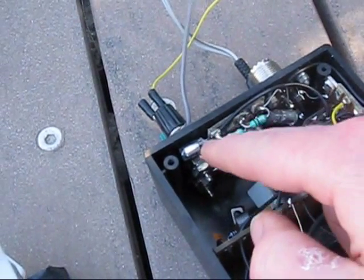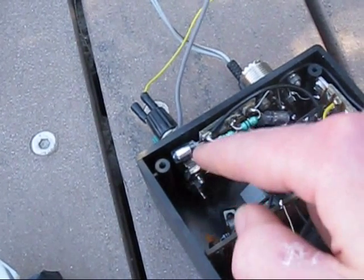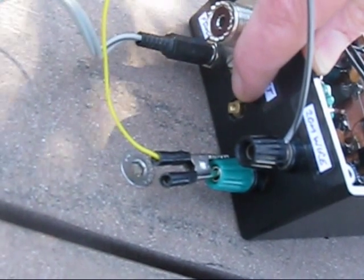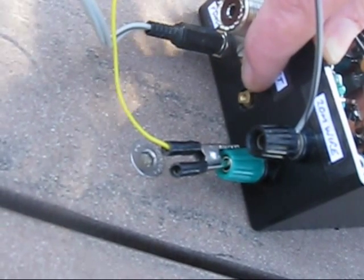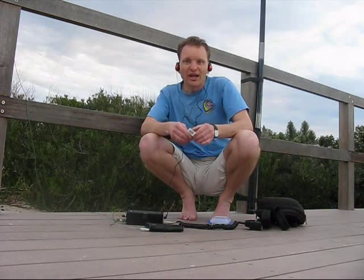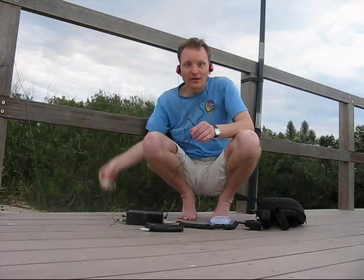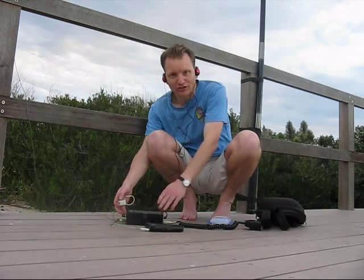You can tell that it's high impedance because when you touch the antenna socket, the signal drops greatly. To tune the antenna in, you just adjust the tuning capacitor's shaft. I didn't bother adding a knob, as it's near enough to a preset control. How do you tune the thing up without an SWR meter? For the first couple of goes, I suggest using a little field strength meter that you can hold near the antenna wire and adjust the tuning capacitor for maximum deflection when you're talking.